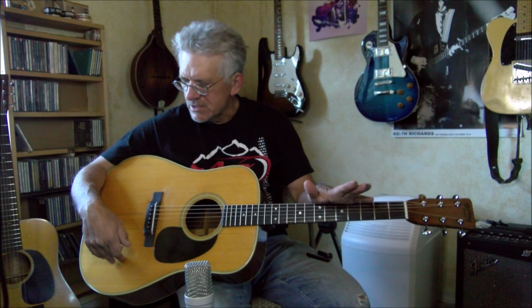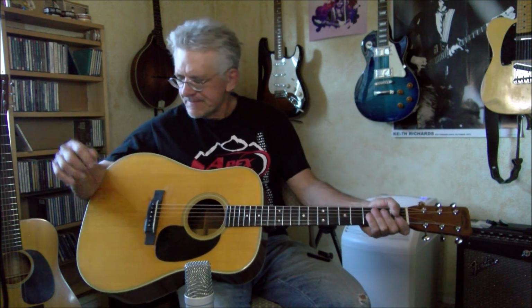So this is a 70's D28. This would be like one step up from the D35. So I did the tuners, I did the nut, I did the popsicle brace. Those things are different from the D35, so it's kind of more into that modified 70's. The only thing I haven't done to this is scalloped braces. And maybe not here. It's not a fully modified 70's, but it's another step up from the D35.